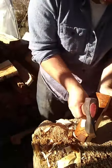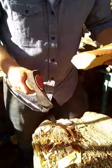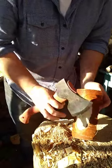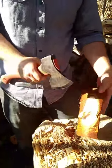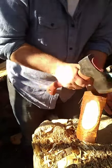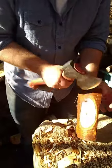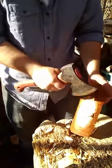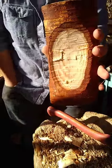Then I either use it up as quick as I can, or I buck it up into short lengths — although you get a fair amount of cracking that way. What I did last year was try a little experiment where I split a log lengthwise to see if it would evaporate enough that way. It won't evaporate as much as short bucked-up lengths because the capillaries aren't exposed the same way, but it did enough. The other thing I want to try is what Dawson does — actually split it up into billets, put it in a plastic tub, and let it mellow that way.